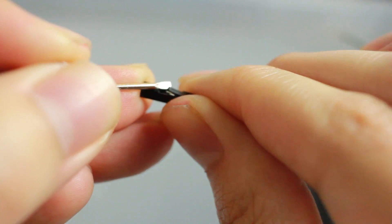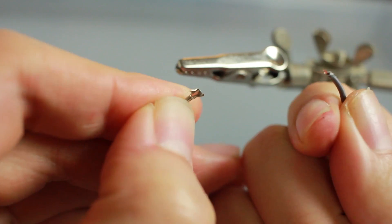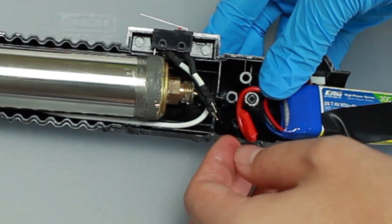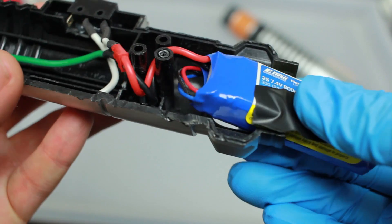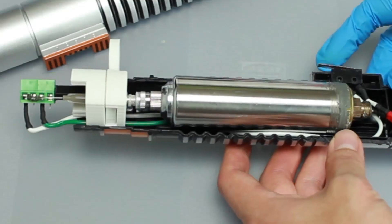The plastic casing can be removed by lifting a clip on the side with a small flathead screwdriver. The wire should then be removed and replaced with larger diameter wire — in this case 14 gauge. To connect to the battery, we'll use header pins. Exposed parts should be covered with heat shrink tubing. With everything laid out, we can now see how the simple ignition circuit works: the switch simply turns the nichrome coil on and off.